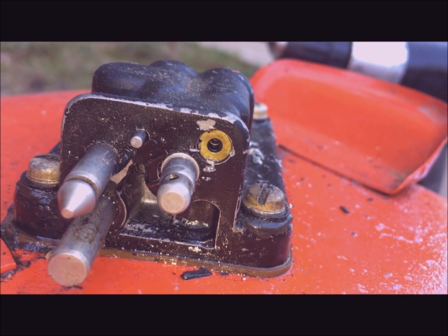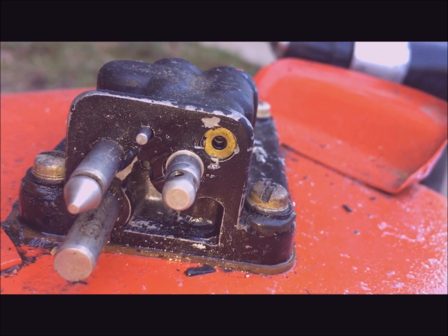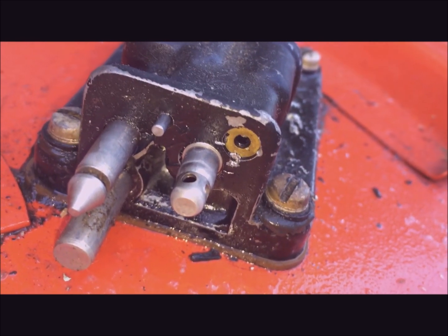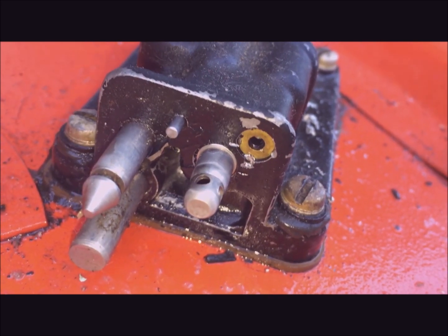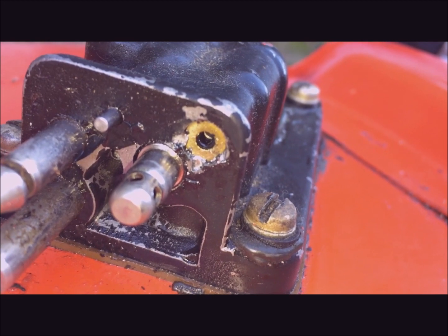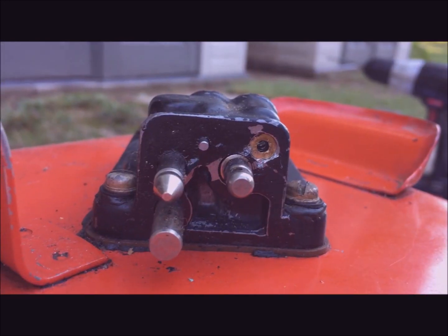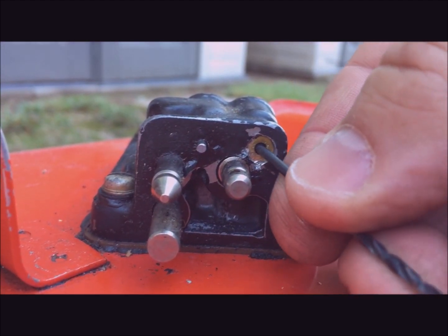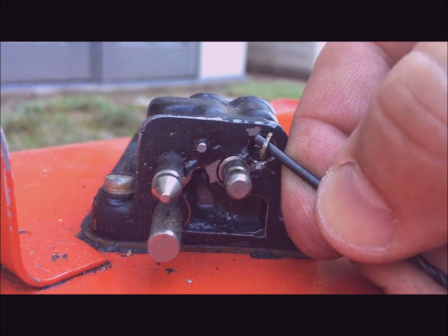Now that the stem is removed you can see this outer washer and the O-ring just inside of it — that has to be removed. This washer has been staked in, so I have to use a chisel to carefully remove the material holding the washer in place. I've been scraping with the knife and chisel point to get the staking cleared off. Then I take a drill bit just a little bit smaller than the hole and rock the washer out of position.